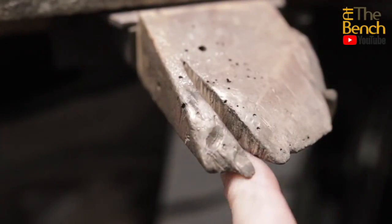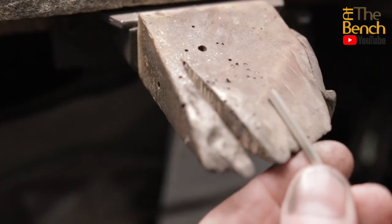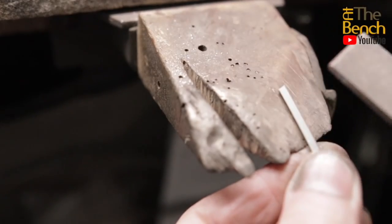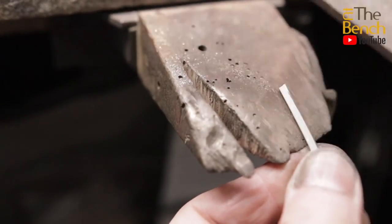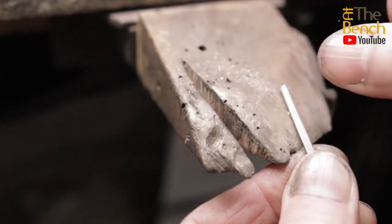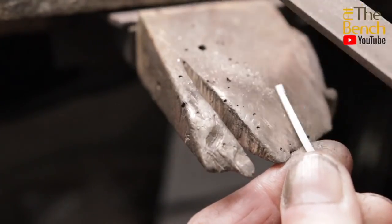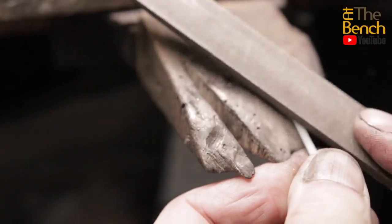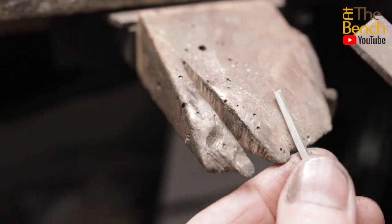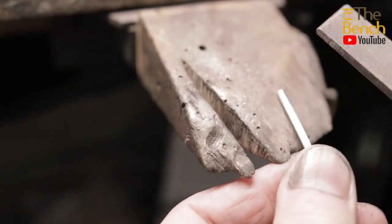So this is our bench peg, a bit of a taper on this bench peg here. So we get our metal, we hold it and you file. You don't file evenly along it, you file more so on the one end. And again, you are just filing off those corners. So you file more on the ends than down here. This is a bit more of a wasteful approach because you're filing and you're getting all your bits of lemel. So hammering it is a better way than this way.